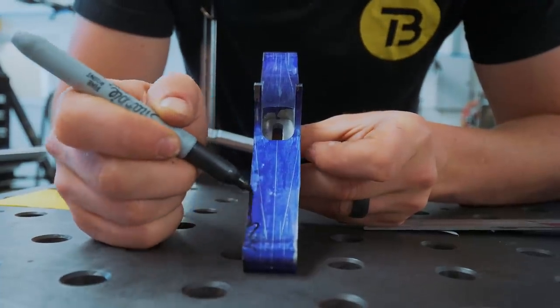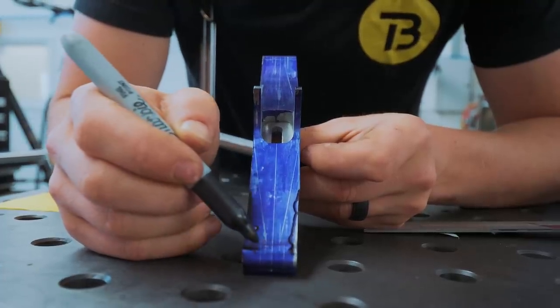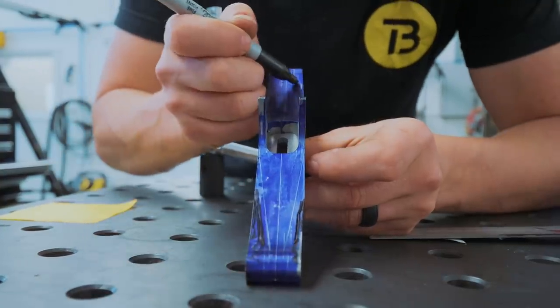So now we're going to cut off all of this material with the grinder, get rid of all of that. That'll leave us a 10 millimeter square on the end to form the ball out of, and it'll get us these nice tapering quillons on both sides.